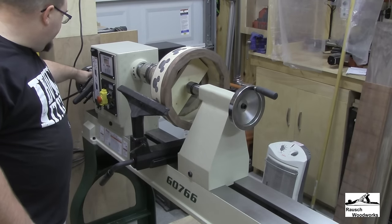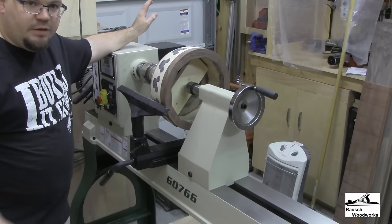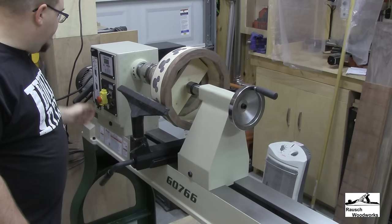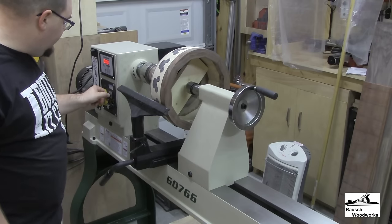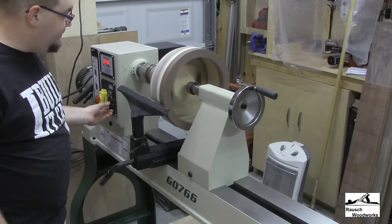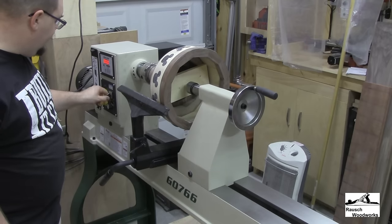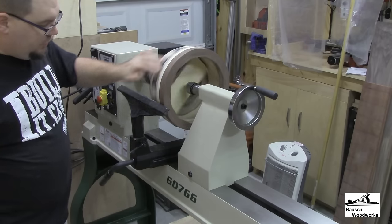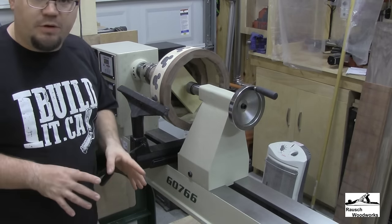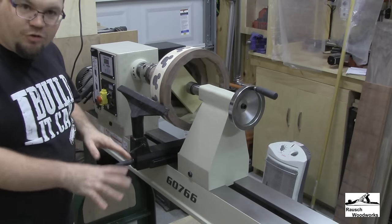The motor is a 3 horsepower that normally uses 3-phase power. It came with a VFD and I've got single-phase 220 power ran to the VFD, so I'm able to actually run the lathe on single-phase 220. I'll fire it up real quick here — it's nice and smooth, very powerful, very quiet. It's got a digital tachometer showing me the speed, and I'm pretty sure it's going to last me probably the rest of my lifetime. At least I hope so. I'm going to do another video on this in the near future talking about all the various features and why I chose it over others.